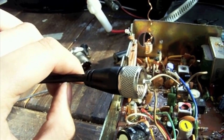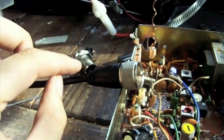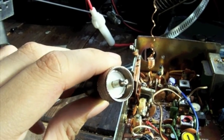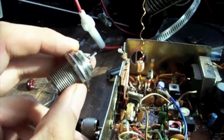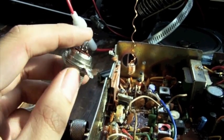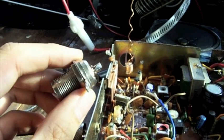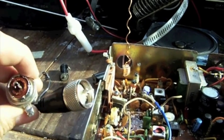That would be the easiest to install and most practical overall — all you need to do is strip one end and solder it into the antenna. Second option, my second most recommended, would be to use a three foot jumper, cut off one end, and put a barrel adapter on one end to make it into a female connection. Third option, which I don't recommend, would be to take out the connector from an old radio — that's the option I'll be using today. I don't recommend it because unless you figure out how to contain it, it'll leave your connections exposed. I'll be using it temporarily until I find a female pigtail connector.